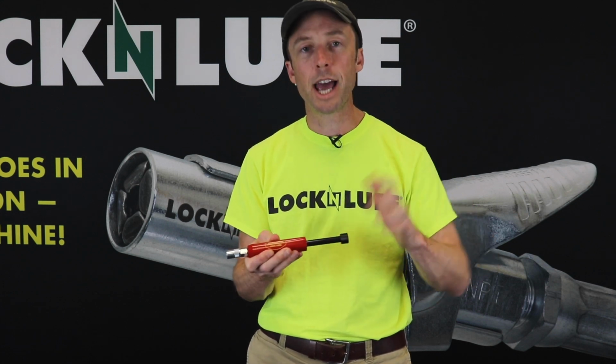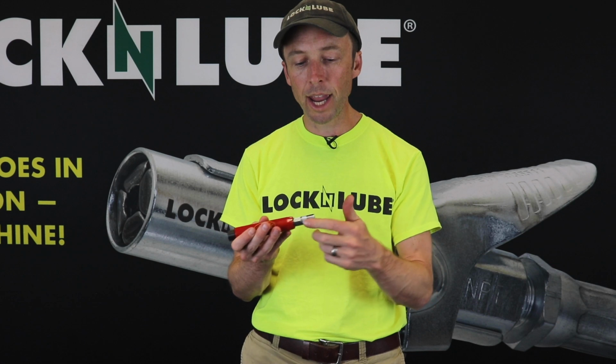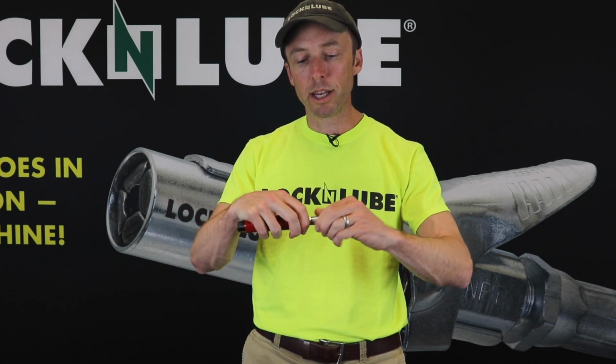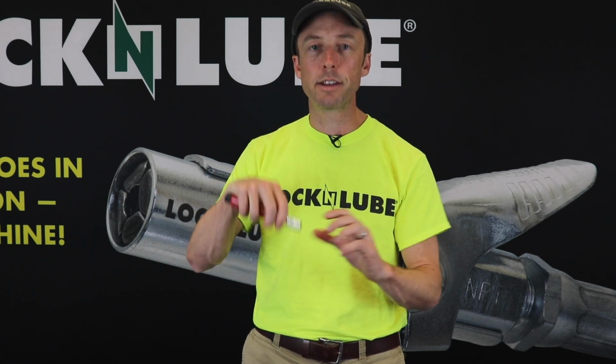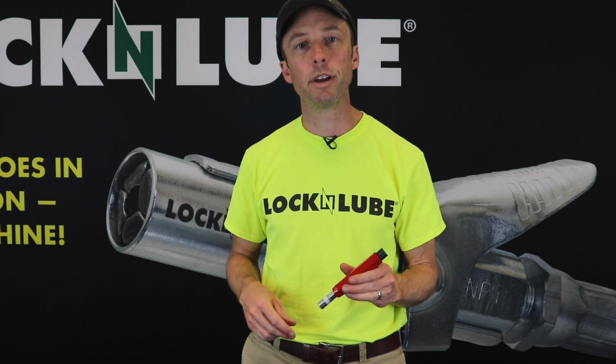We also use a hexagonal bar stock for the chamber itself. That gives you a nice good grip on this while you're working with it. And a 4-jaw grease coupler with an adjustable ring here is going to allow you to loosen it up to get on the fitting, snug it down once you're on there, and make sure that all that solvent is going right into the fitting.